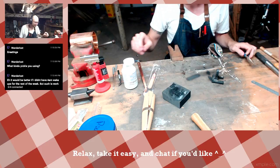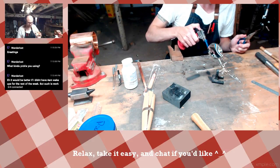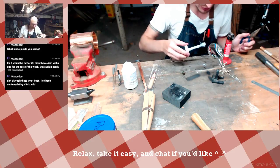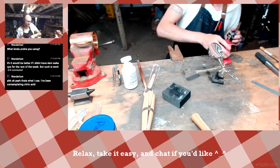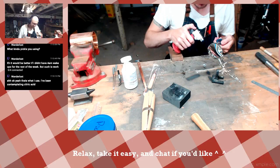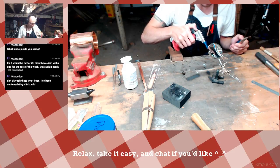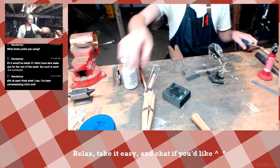Alright. Get our flux on here. Okay. And I'm actually going to turn my heat down a little, because it's going pretty quickly. I lost the flux. It came off. So I don't think it's coating the joint well enough. Alright, that's better. Okay. Okay, and there it goes. Our solder flowed. Trying to pull it down a bit. Alright, let's pull it off and put it in the pickle.